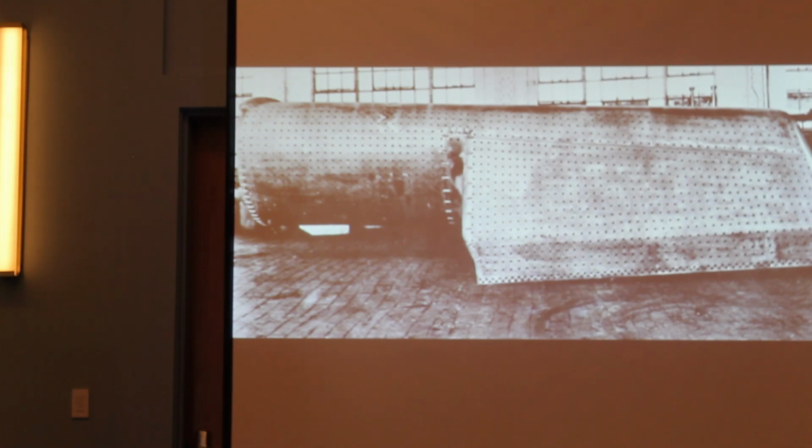That's safe ending. And it saved the railroads a lot of money over the years. And the rule was you may have up to 3 safe ends per tube. I'm not sure where they come up with that, but that's what the ICC rules were. Now, we did 475's overhaul for the first time back in 1991. We took the tubes out, and I was amazed to see there were quite a few tubes that had 4 and 5 safe ends on there. But if the ICC guys are around, hey, you know, you don't get caught. And they worked fine, but 3 was the maximum you were allowed to do by the rules.